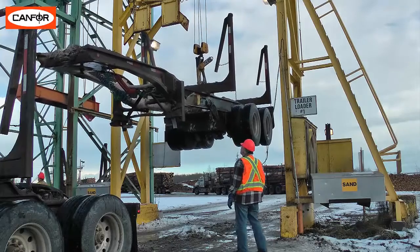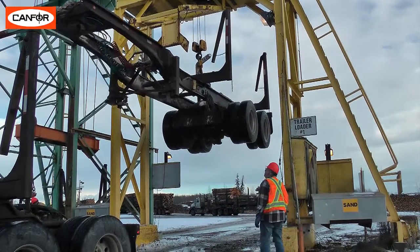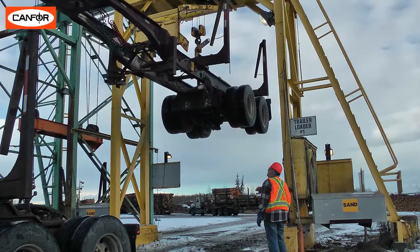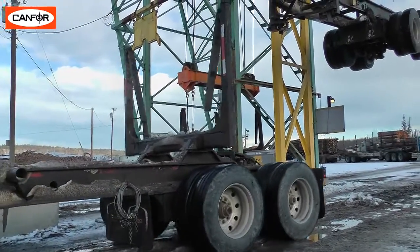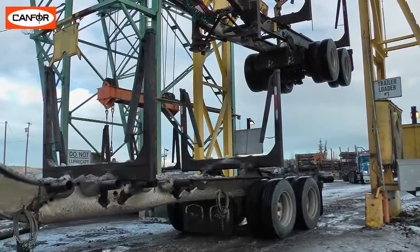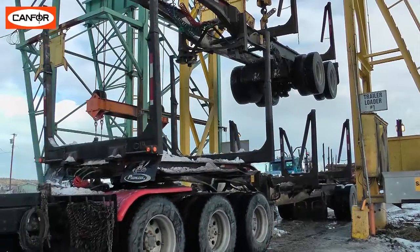Always use the provided pipe pulls to square up the suspended trailer, and never use your hands or walk under a suspended trailer. Ensure that the trailer hoist block is high enough for the truck to get under, and always return it to its original position so it is ready for the next truck. Do not run your trailer stakes into the trailer hoist. Always be aware of your trailer height in relation to the upper parts of the trailer hoist.